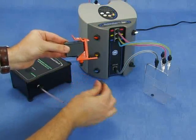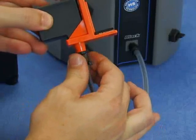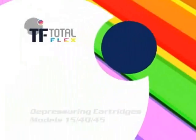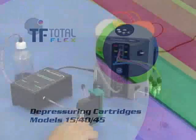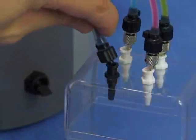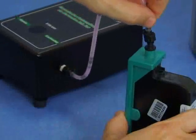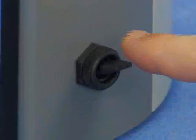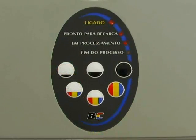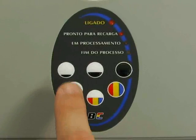If you would like to refill another sponge cartridge, make sure the cartridge is empty and repeat the refilling procedure. Depressurizing cartridges models 15, 40, and 45: after this cartridge type has been refilled, keep the cartridge with the print head upwards. Remove the connector from the adapter and connect it to the ACD's hose. Lower the black key and press the min-load button on the panel. Wait until the end of the process. In case you don't see the ink flowing through the hose connected to the print head by the end of depressurization, repeat the process.